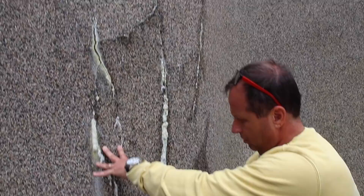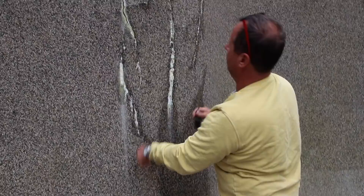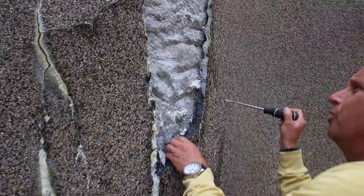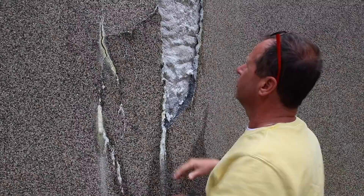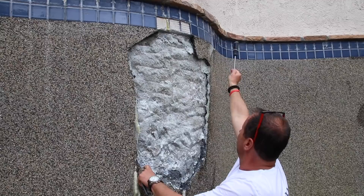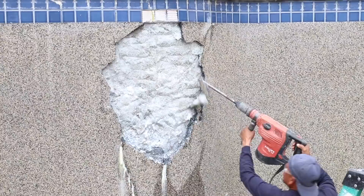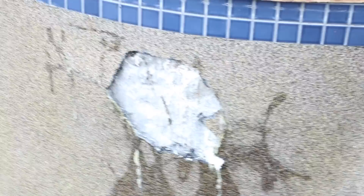That's solid — but we still have the structural crack. Watch what happens when we pop it. You know why this cracked? It's because they went so thick. See how thick that is? See how thin it is here and how thick it is over there? So aside from this being all hollow going back, we have some hollowness on the bond beam. It's solid there, solid over there — but that's all going to come off. Now we're going to chip it off and chip out everything loose underneath it. We need to take a good peek underneath to see if we have anything structural, and in this case we actually do. There is a structural crack running behind, and we found structural cracking in the others as well. That efflorescence stays back there because water gets behind it, as you just saw in that video.